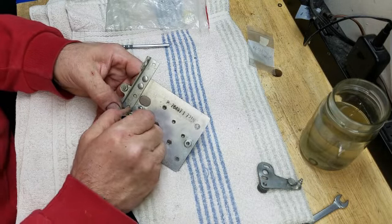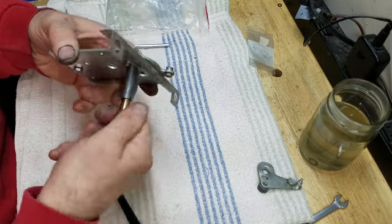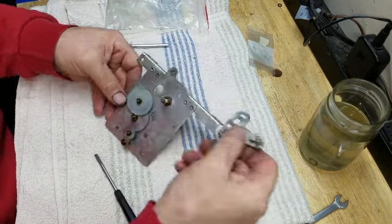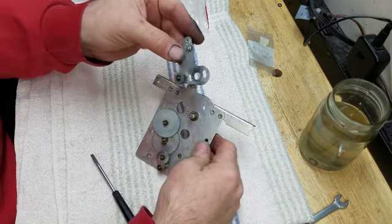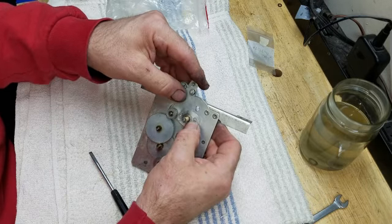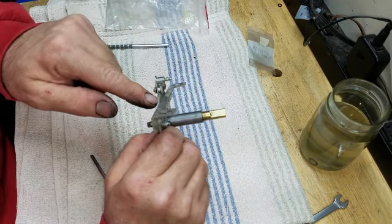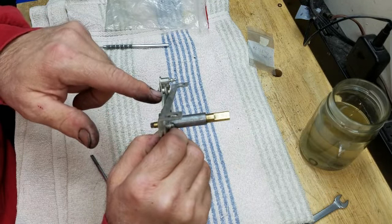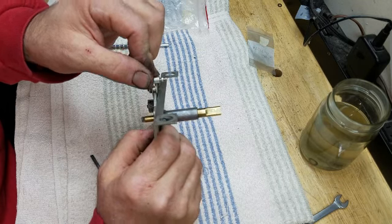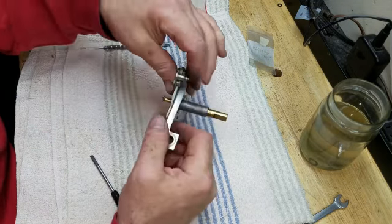These are what I call star washers — they're little serrated washers. This has some minor adjustment, as I show you here. It's starting to feel pretty good now — yeah, it's loosening up great. So this little lever — this is the mechanism that engages and disengages the manual tuning. It sits on here like so, and then it pivots on that. It rides on this little channeled pin, which rides on this little groove. This thing straddles this part of the bracket and rides on it — that acts as a guide. There's another gear that fits over this guy, and that's what I'm doing right now — getting that gear prepared. That's the one with the little screws. Catch of the day — one small washer.